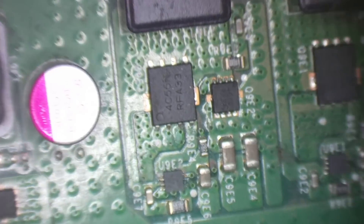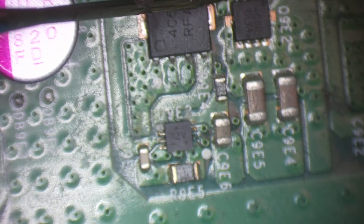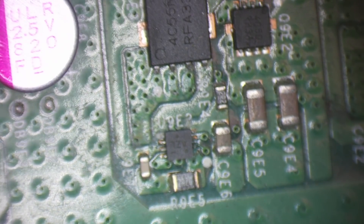It's had a little bit of liquid damage on that pin. That MOSFET is shorted — 0.01 volts drop to ground on that MOSFET — so that MOSFET's bad. We also have corrosion around the MOSFET driver.